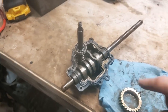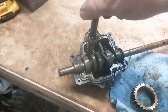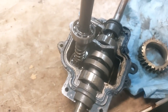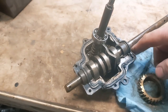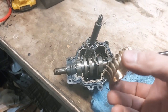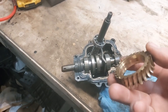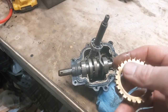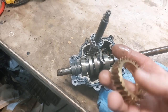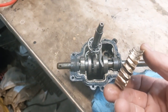Here is the transmission, and not present on this shaft is the gear I'm going to show you. It's a worm drive — the worm gear is there. Crappy little plastic housing. Here's the gear in question. These things drive me insane. I guess they put them in as some sort of engineered weak link, which is stupid, because this thing has a clutch — two slightly cone-shaped discs that bear into this gear from both sides. This little lever is what actuates it. Anyways, this thing ate itself.